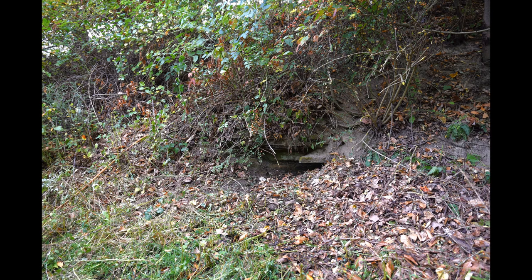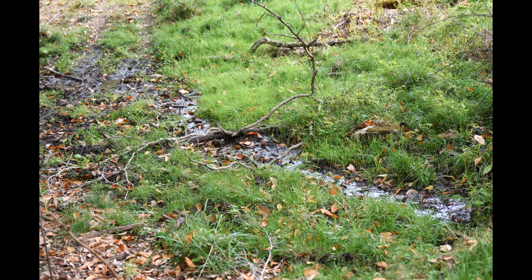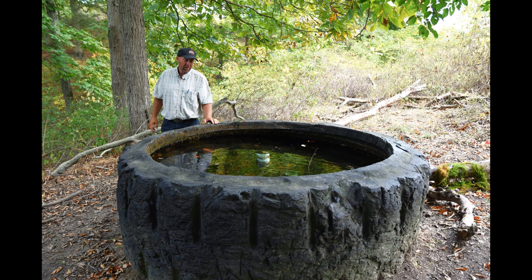Here is an example of what a spring development looks like locally out in the field. We have a seep coming out of the hillside, and as it presents itself coming out into our pasture field creating a wet spot, we can put some perforated pipe and some gravel into the ground, collect this excess water that is running off, and send it into a stock tank with the proper holding capacity for whatever livestock may be drinking out of it at one time.